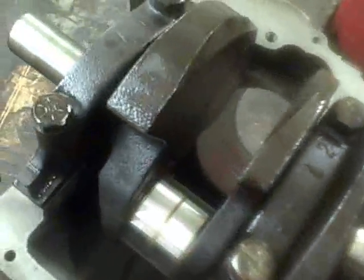We got our bolts set in here, so now it's time to crank those down. We go over to our handy dandy Chilton's book here and look for the 400. We look under main bearing bolts, and it tells us to torque them down to 35 to 45, with a note on bolt 11 — which says 78 to 80, then 95 to 105 pounds. So I have set my torque wrench to 105 pounds and we're going to get all this torqued down.